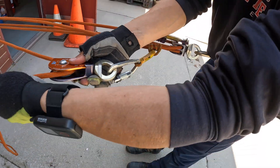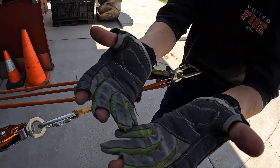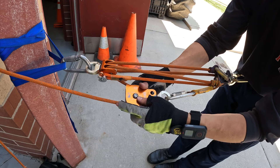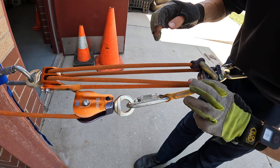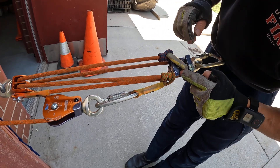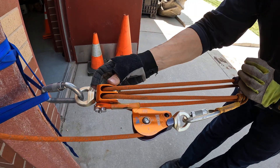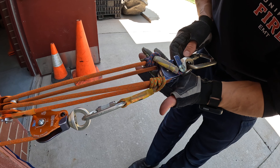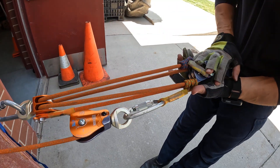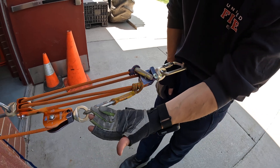Let's see what that looks like. We're going to apply some tension and do the T-method. One in, one out — two. One in, one out — two. To the Prusik, that's three; three in, three out — six. Three in, three out — three continues on; three in, three out — another six. It terminates: six plus six is twelve. So twelve-to-one mechanical advantage on the Aztec.